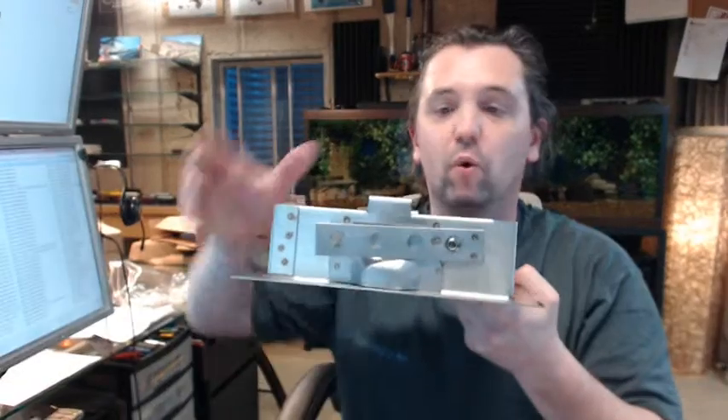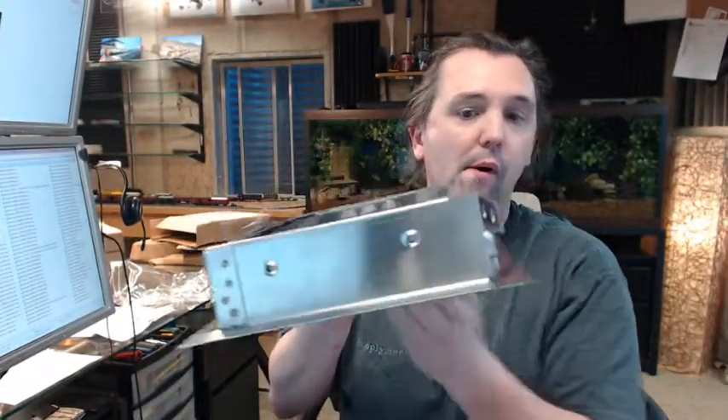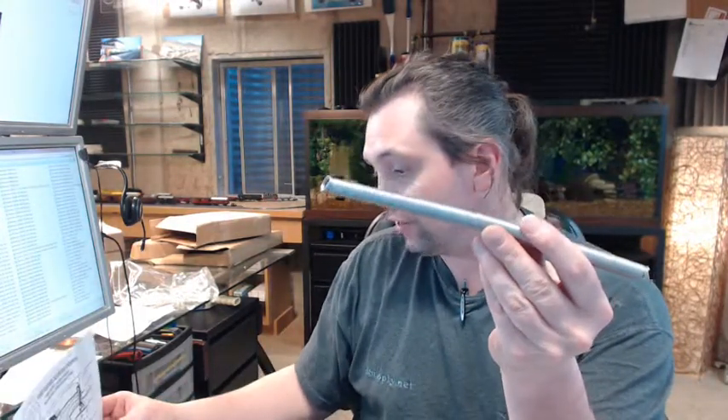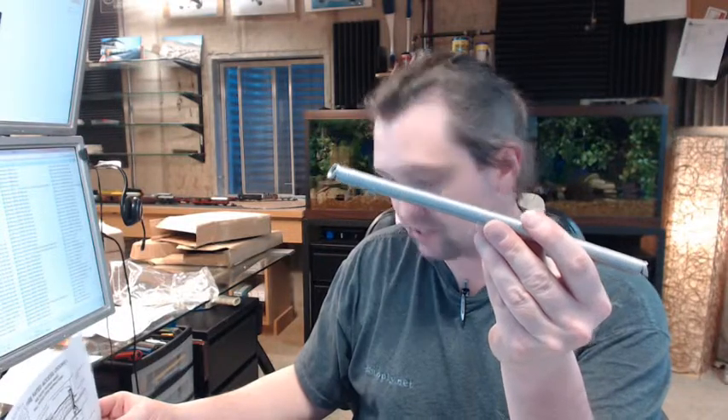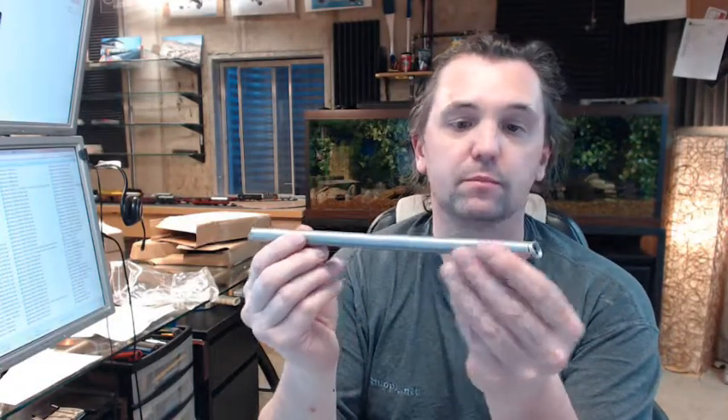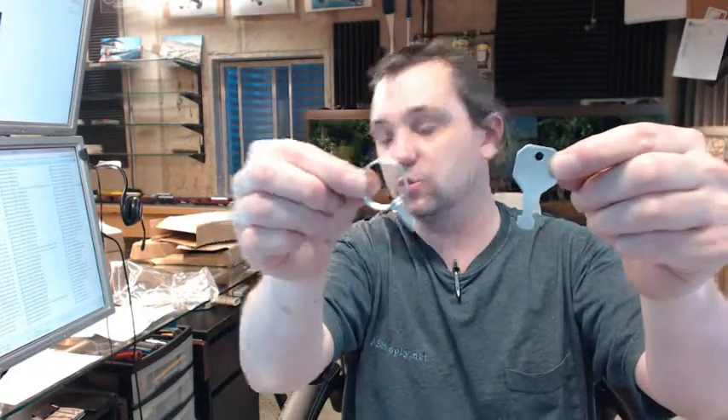You have countersinks in all four ends for your fasteners. There is some ancillary material that goes along with this. With these fire rated access panels you are going to have a spring, and if your panel is larger than 16x16 you are going to have two springs. It looks just like a storm door spring. You are also going to get, because these panels feature a dual lock, a threaded turn key and then a typical skeleton key. You can buy these separately as well — they are available on the website.